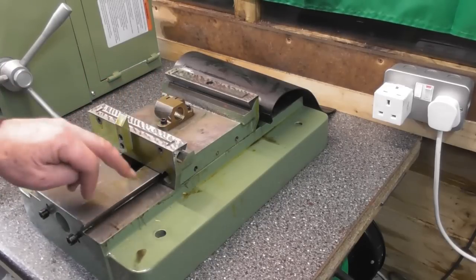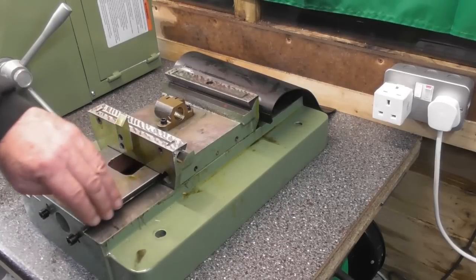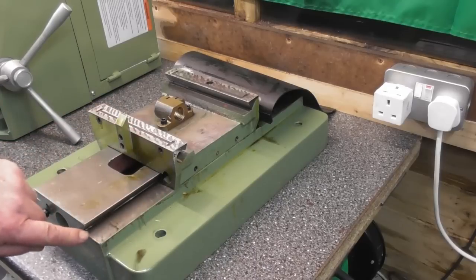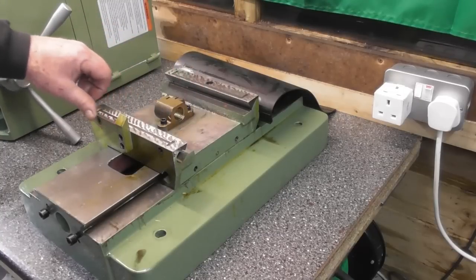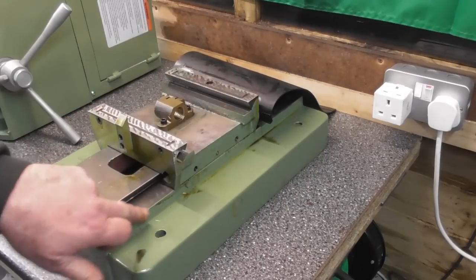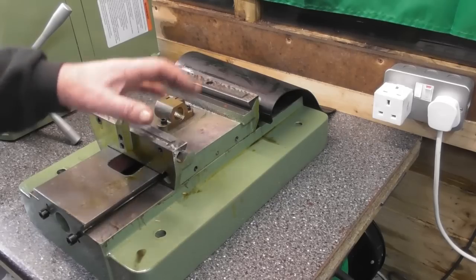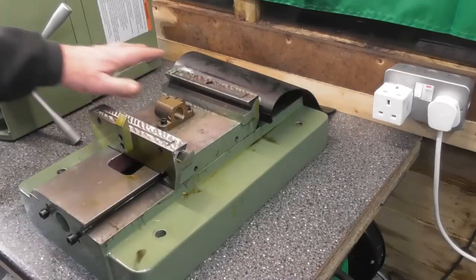These aren't too bad actually, but this one looks like it's been run down with a disc sander to take this corner off, and I can feel burrs as I run my hand down there. I'm going to be using an oilstone on the outer edge here — it's quite sharp. Same that side, same out here. I'm going to strip it and all these sharp edges on the outer edges I'm going to oilstone, and I'm going to do a little bit of addressing of these grooves that let the oil run out, because this is the major axis of continuous movement — the table running back and forth here.